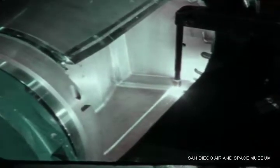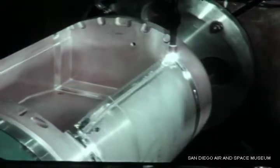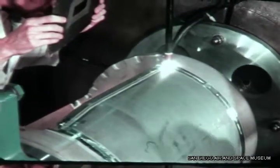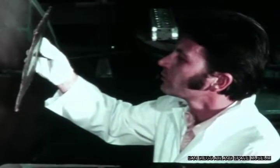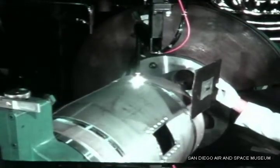All welding parameters are normally maintained constant in long continuous areas, and the computer is reading the digital output of the drive encoder — in this case, the turntable shaft position. The next table position flag triggers the computer to read the next data line from its memory. The next line at this joint contains a data word to command the torch rotation motor to operate. The torch arm assembly must be repositioned 180 degrees to permit re-entry into the cavity area from the opposite side.